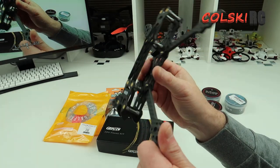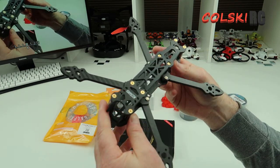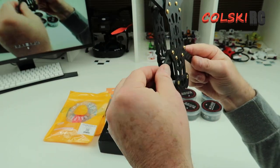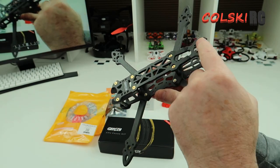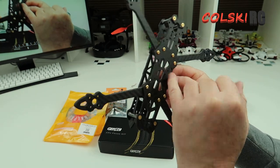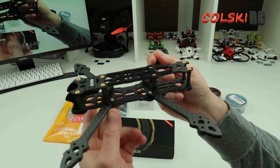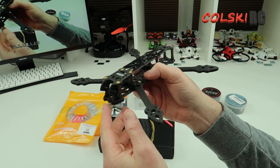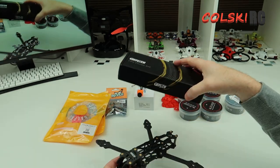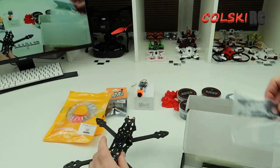So this is the frame - I absolutely love it. This is the frame when it's made up. It comes with a set of instructions and it's very, very easy to make up. The fit and finish is super. Look at the finish on the carbon - it's dead smooth. It's got chamfered edges all over, countersunk holes for your bolts at the top and bottom. I like these button screws. These are the screws for your stack, and it will hold 20x20 or 30x30 stacks. It's obviously a freestyle frame because the arms are set back, and it comes with a nice camera mount in the front. In the kit you get that, and you get a silicone mat plus a spare, which is great to see.